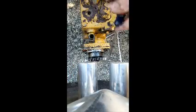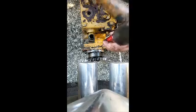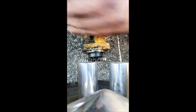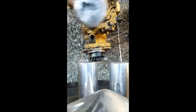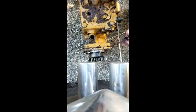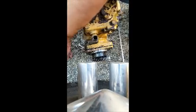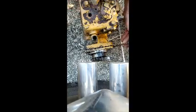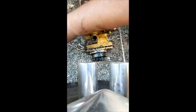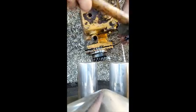So this new compressor don't have this adapter here. So all I'm doing is taking the screwdriver and kind of prying it here and there with a hammer, and kind of getting it off of there. That way I can put it on the new one. The compressor came with paper gaskets, but the guy at Kenworth gave me some rubber O-rings, I guess, for this particular application.